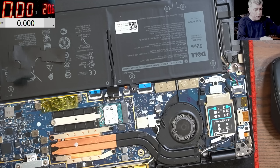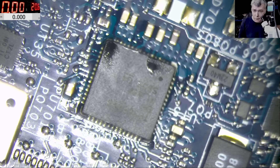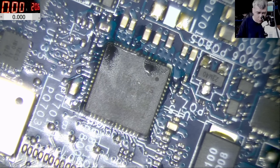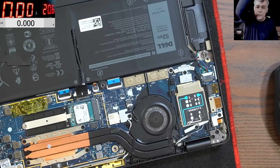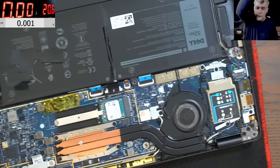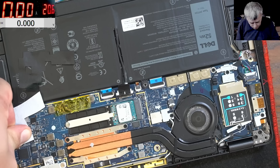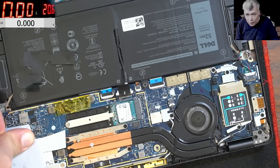The chip is soldered in place — we can see it's soldered around place. Perfect, it looks perfect. Let's cool down the chip using a heat pad. I want to see the 3.3V — 3.3 is present. That means we've done the job. I believe it's a 3.3 LDO and 1.8 LDO coming out from this chip.